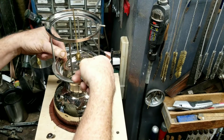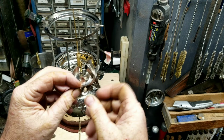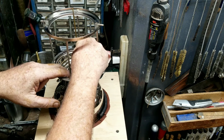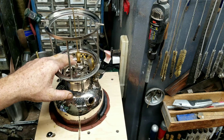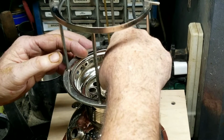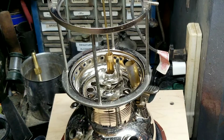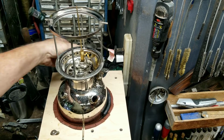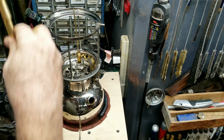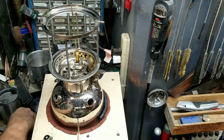Bottom plate back in. It'll only go in one direction. And our burner priming pan. It's got a little hole that will fit right down in and go right around that generator tube. Try to line this back up. Well, I think I done it first try. Not often that happens. Okay, I want to make sure that tip cleaner is in the down position. Carefully drop this right over the needle. Maybe we'll take this tip back off first.